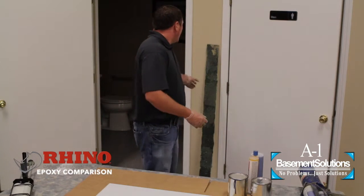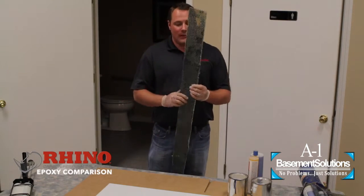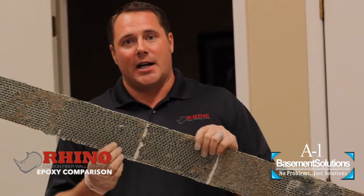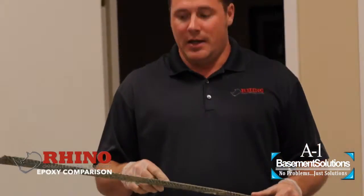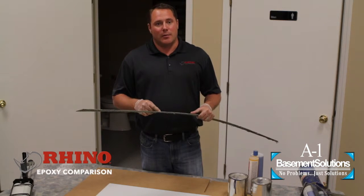When you look at one of the straps that comes off the wall, it looks really cool when it's up against the wall. But when it pops off the wall because it failed because of the bond, it has virtually no concrete on the back of it. When you're applying carbon fiber to the wall, we know the epoxy is stronger than the wall and the carbon fiber is stronger than the wall. What we're concerned about is the strength of the concrete block. So when you put your epoxy on the wall, you want it to penetrate back into the pores of the block and actually seal into the block.